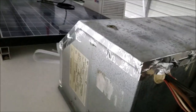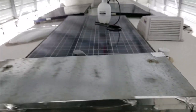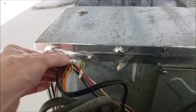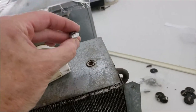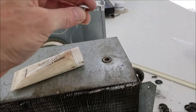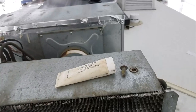Okay, about to wrap up this project - I took some foil tape and went over all my seams to get a nice tight seal, maybe make things just a little bit more efficient. A couple more tips: my wires were loose so I put some butyl putty in to get those wires sealed up good. I put a few drops of oil down here on the motor shaft - don't know if it'll do much good without a proper oil hole, but maybe it'll help a little. I can see where I've done it before and this thing is 18 years old and still going. Another tip: when you take these tops off and those screws are really tight, use an electric impact. The screws are stainless steel but I'm not sure about the nut, so I put a little dab of grease in each hole before putting them back together to keep the water out.